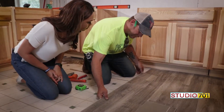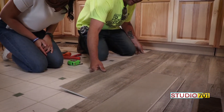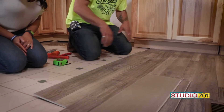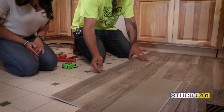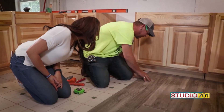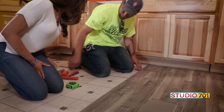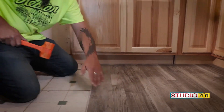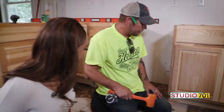This particular kind is really simple. If you're familiar with the wood kind, you kind of have to beat it into place and snap them together with a hammer. This stuff is really not that hard — you just lay it in, get this nice edge here, make sure it's all the way up tight against this edge, and then you take a mallet and just snap it together. That's it — the piece is installed.